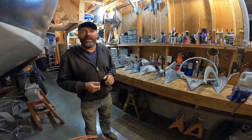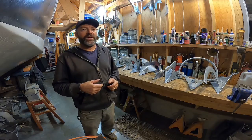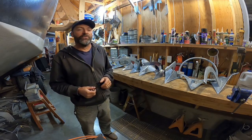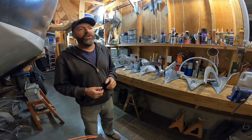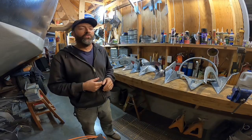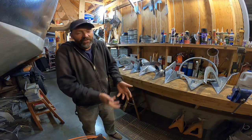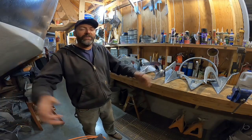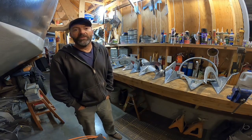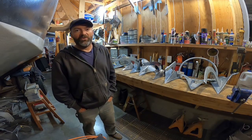A challenge that I had to face was I did not want to do a horizontal pull or an infinite scope pull. I like to do anchor testing at, say, middle scope numbers. And what we ended up with was a 6-to-1 scope. And you're going to be wondering, well, how the heck did you pull on an anchor at 6-to-1 scope without having the truck out in the water? And the answer is I constructed a large wheel that elevates the rode. This apparatus does go out into the surf, and it's waterproof and it doesn't float away, so it worked out real well. Before we get to the anchor test, I'm going to show you a minute or so of the construction of that big wheel. So here it is.